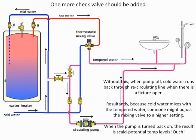Copper Development Association recommends a very low flow through copper tube on a hot water recirc line. Most engineers who are in the know will design them to be 1 to 2 feet per second. If a contractor increases the pump size, all of a sudden that's up to 6 to 7 feet per second. That pipe will be pitted in about 2 years.